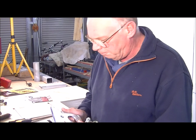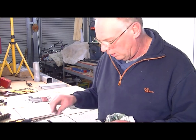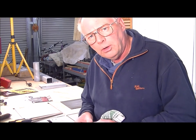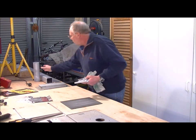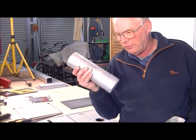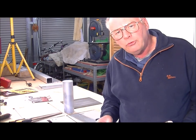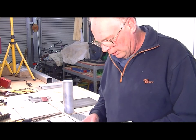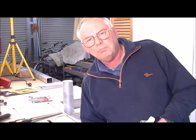The next job is to turn up the two risers that I want to put here, because you have to step this out. I've got some 25mm bar stock I can do that out of quickly. And I've also got some 90mm bar stock — that's quite expensive stuff here in Australia. So I'm going to turn up the pulleys now. I'll film a little bit of the roughing out to make a pulley; it's a pretty simple job on a manual lathe.